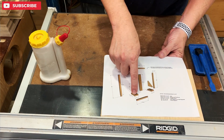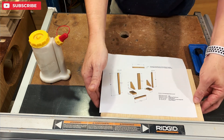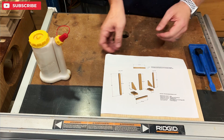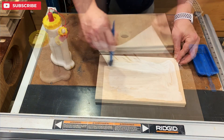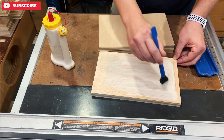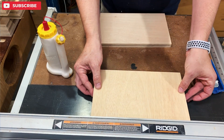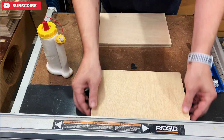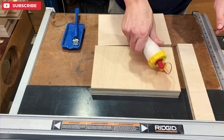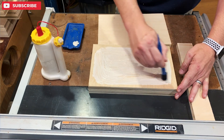I just cut out the caster supports — cut 12 of them, three times four all the way around the table. I'm going to do it just like I did with the angle brackets: stack three up, pin nail it, and then put them all on the clamp after I'm done. As you can see, I'm using whatever method I have. This time I had my table saw fence to help me line these up — just use my fingers on the sides and the table saw for the front. That helps make a nice square lamination. Pin nails temporarily until I get them into the clamps. Use plenty of glue and wipe off the excess.